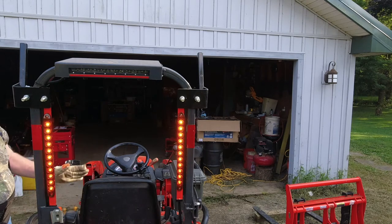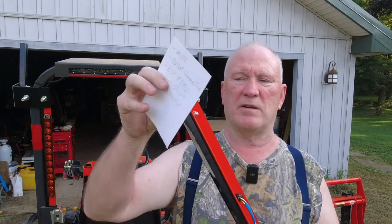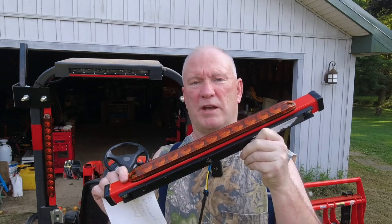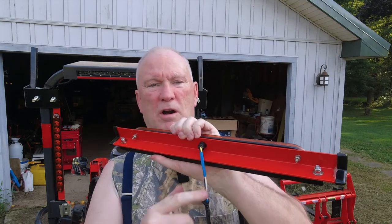This is a 16-inch light bar and I think it's pretty visible at night. This is the one-and-a-quarter-inch angle iron I used. I got some vinyl end covers for it. I used the same type of magnet that John Ritter used — it's the toolbar magnet at Harbor Freight. I got 16-inch trailer lights off of Amazon; I got the amber, but you can get them in red, white, or amber. I used stainless hardware to secure them, and I painted it Allis Chalmers orange — close enough to Kubota for me.